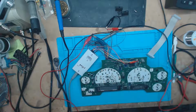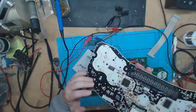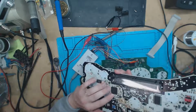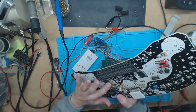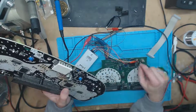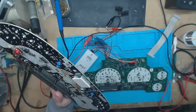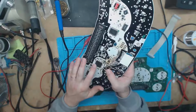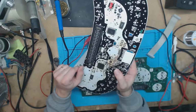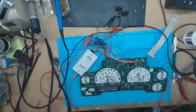Maybe I'll be able to do this JTAG connection to these older ones here. I have not been able to find a data sheet for this. If anybody has a data sheet for this, I would love to have it, because it does not have anything staring at us telling us, hey, I'm a JTAG connection like this. That was pretty obvious on the other one. You have five open pins that nothing's going to. I mean, that's going to be JTAG. This one, nothing stares out as JTAG, but most of these kind of processors have a dedicated JTAG on them. So, yeah, if anybody has the data sheet for this, I would be very happy to see it, so that way I could try to do this kind of stuff to it.